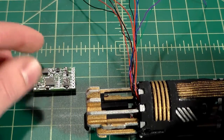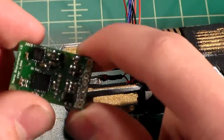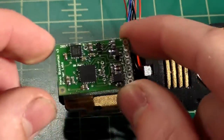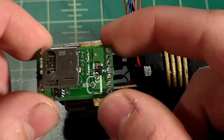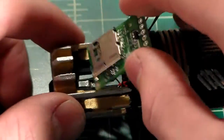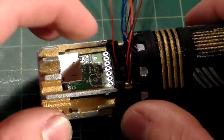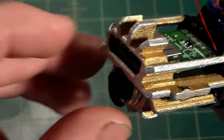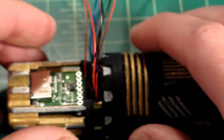so now we can get on with simply soldering it together. One thing to note, however, is that this is the layout for the wiring if the soundboard was to be installed like this. Unfortunately, in order to install it in this chassis, it has to be reversed because that's how it's going to slide into the chassis, so that the SD card slot is accessible through the window. It has to be installed technically upside down.